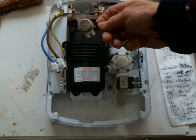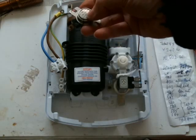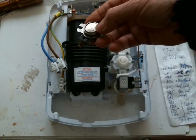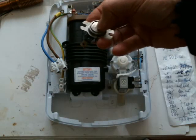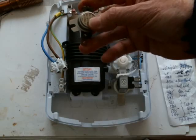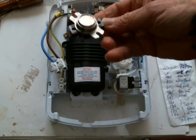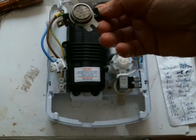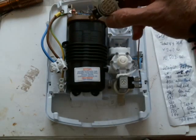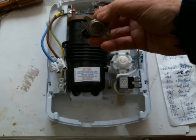The switch is slightly cleverer than it looks because it's got two bimetal strip discs in it. The first one is resettable, so that's why it resets when it cools down again. The second bimetal disc behind this one won't reset - once it goes, that's it and you get no more power to the boiler. The first warning comes when the first bimetal strip goes at about 60 degrees, which would be a pretty hot shower. The second one goes when it reaches 80 degrees, which is dangerous, so that's why it won't reset.